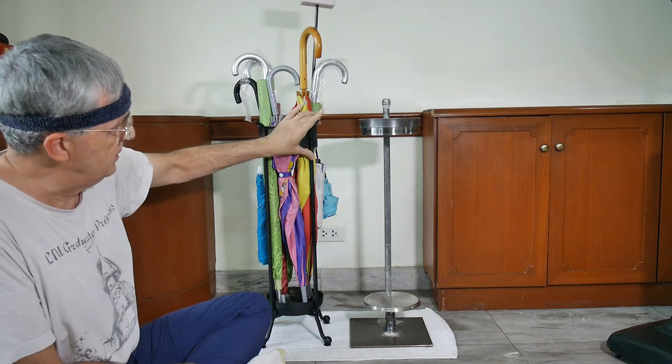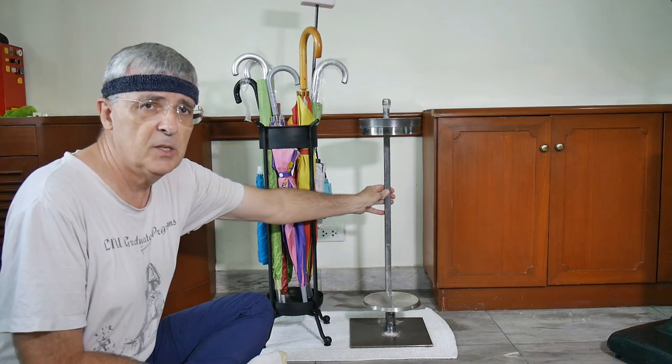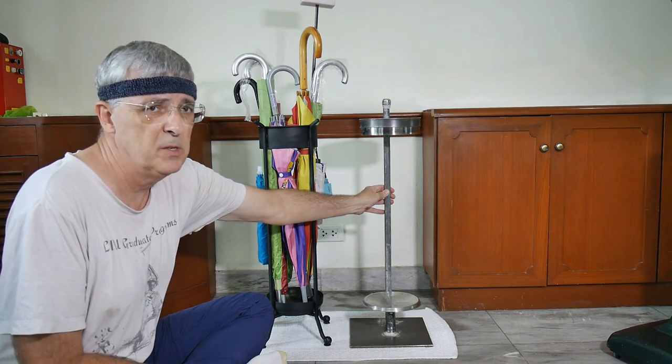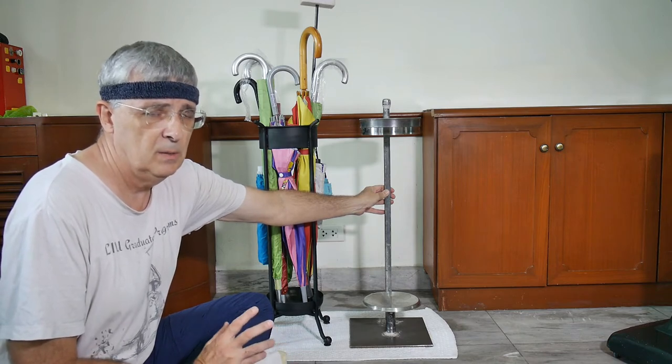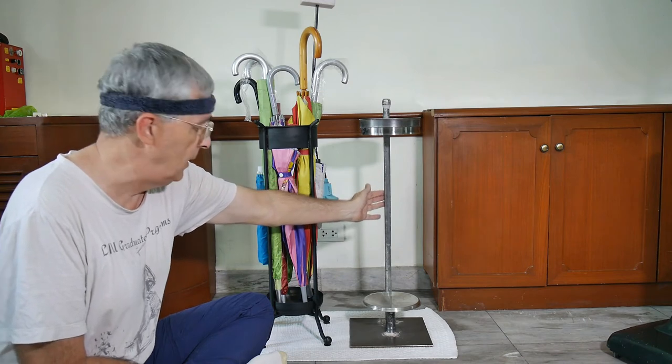The support on the traditional one is the square stock. On the modern one the support is a heavy gauge pipe. Now this one is galvanized — I don't recommend galvanized. You can poison yourself welding it if you don't know what you're doing, so just use any heavy piece of steel pipe, and preferably not galvanized.